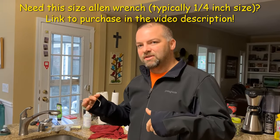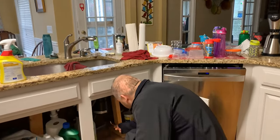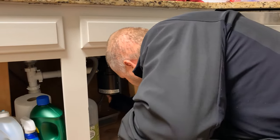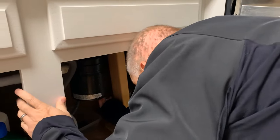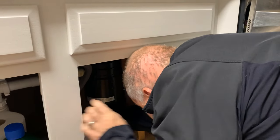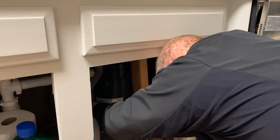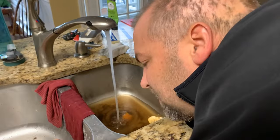If you need to buy one of these I'll leave a link in the description to an allen set. You can also use a standard size allen wrench with the standard L-shape — I'll leave a link for that kit as well, since that's probably a little more common than the tool that comes with the disposal. You get up underneath and there will be a hexagon port right there at the bottom. You get your allen key in there and turn it — the propeller is gonna spin. You might have to get a little bit of an angle and do it a couple times to make sure it's actually spinning freely. In this case it's spinning, so whatever was going on there is probably now working.